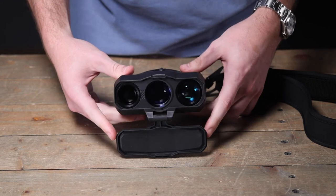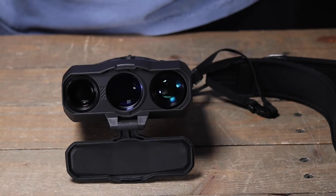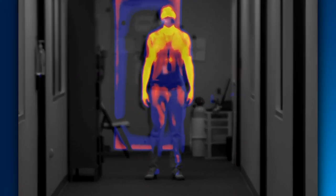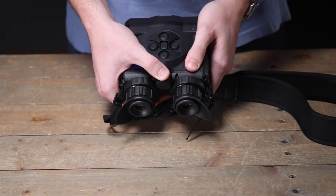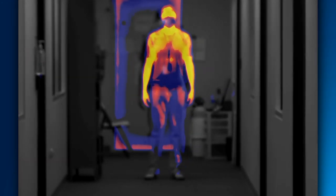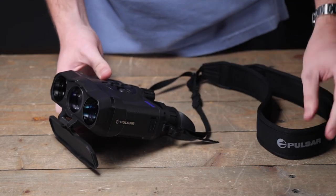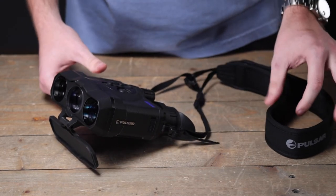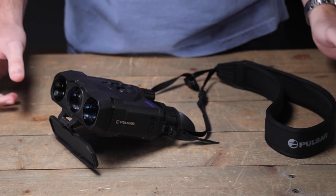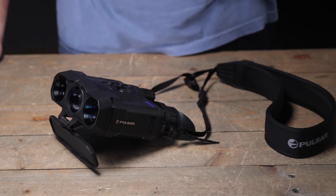The last mode is fusion mode — a digital night vision image with a thermal overlay. You might notice the thermal overlay doesn't quite match up to the digital night vision image; simply use the focus adjustment to match up the thermal overlay over the top of the digital image. The reason is that you're working with different magnifications and different lenses, which makes overlaying thermal and digital night vision very difficult. This is why the thermal channel is fixed focus only.